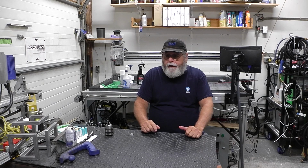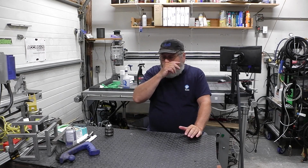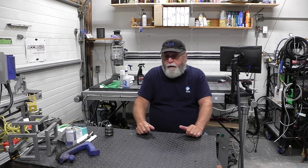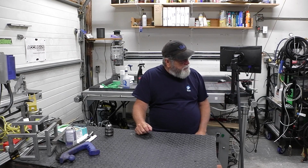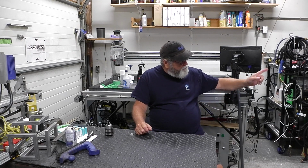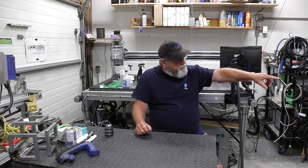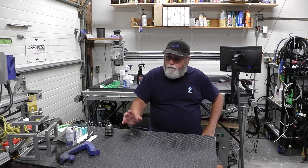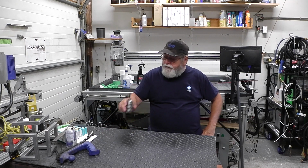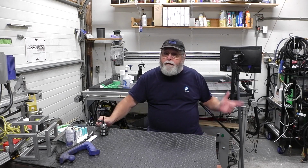So today we got that shaft for our tube notching machine. We did some work on the lathe there a couple days ago. And now I had to set up my rotary table on the mill and kind of rig it up with a V-block in the vise so I could cut the flats for this 5/8 drill chuck. So we're going to get to the mill and start that.